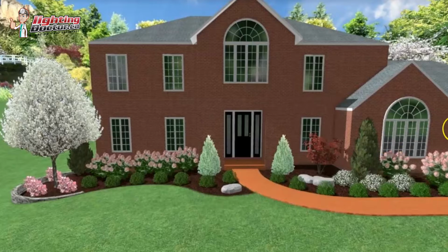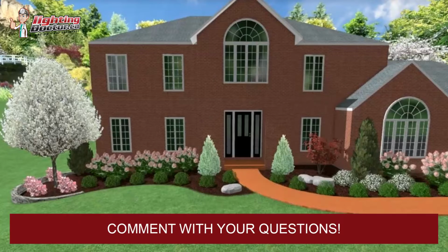If these trees are going to be too close and they're on both ends, you can always bring that a little bit further back to still have it shine fairly upright, so it's getting here, but then it'll highlight those trees a little bit as well. I'm a bigger fan of trying to light the brick and then just get the silhouette of those plants in front of it. Always looks really nice. So that's what I would do across the front of the house to light those areas.